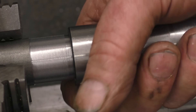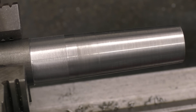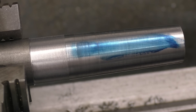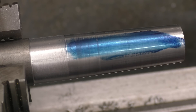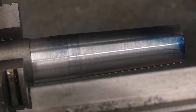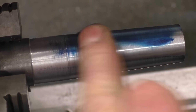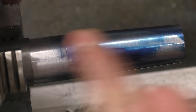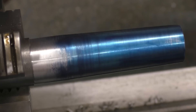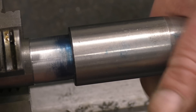I'm trying to get a feel for the grip on the taper, so I'll put some engineer's blue on there and we'll see what sort of fit we've actually got. Doesn't take much. I used to mix a little bit of light oil in with it to cheat and make the fit look better than it actually was. Now we push this on and give it a turn.